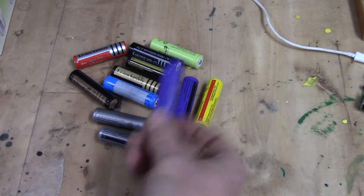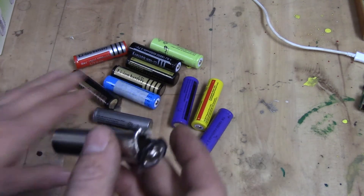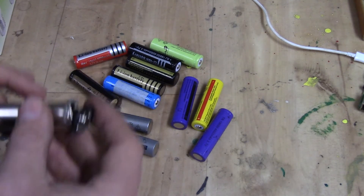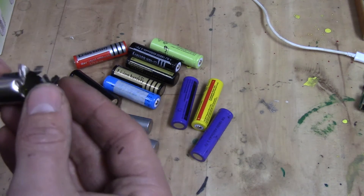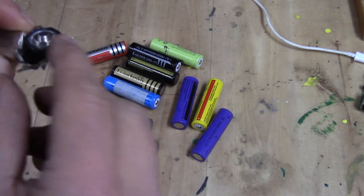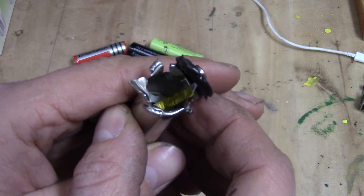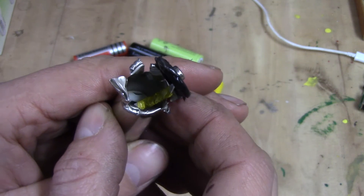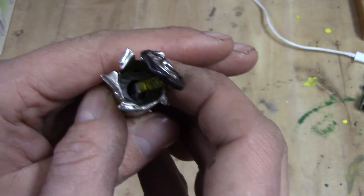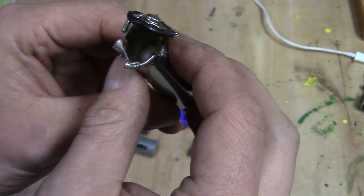A normal battery that is genuine, like this Samsung brand here, weighs roughly 44 grams. Why are they so damn light? Let's take a look. Here you have a battery opened up. First of all, all of those batteries around here are said to have protective circuitry inside. If they would have had it, they most likely have it in the top here. But as you can see, it's just connected directly to the top valve. And if we try to take a look inside, it looks like a big damn gap before you actually see the cell. And the wrap in the cell is also hollow — there's nothing there. No wonder this doesn't weigh anything.